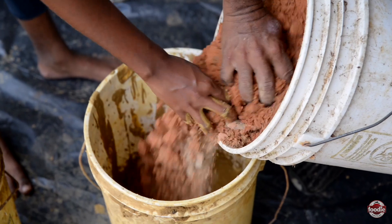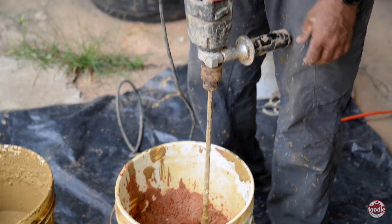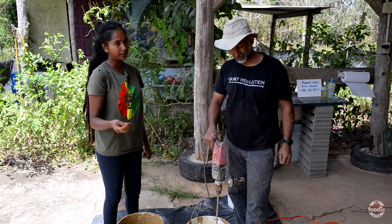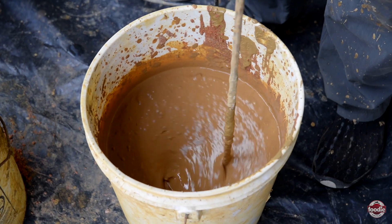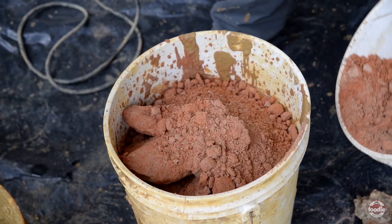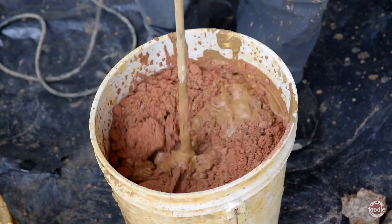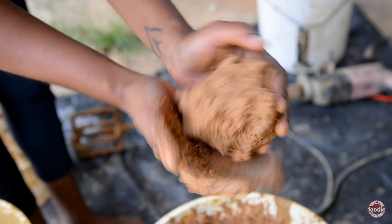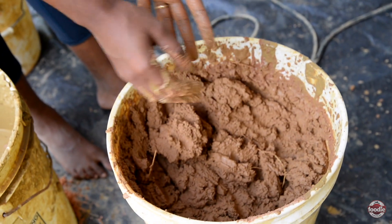We put about so much clay and then pour the sand over it. The sand is just red sand that we stockpiled. We would mix it with our hands or feet but the drill works best for the better mortar because you want it to be as smooth as possible. We're looking for — it's like any mortar that you make with concrete — a kind of toothpaste-y consistency. Something that's not too loose but kind of stays form in your hand.